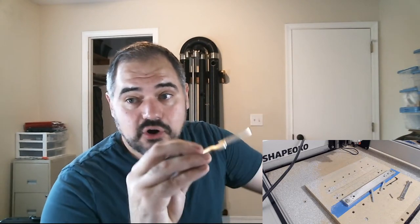These are made out of nickel silver, which is essentially an alloy of brass, but with more nickel, so it's harder. The big advantage there is it's stiffer, it's harder to bend, so the key work will be a little more robust. The downside is it's harder to machine. Specifically, I used what's called C752. That's the specific alloy of nickel silver I used. It's about 60% copper, 20% nickel, 20% zinc.